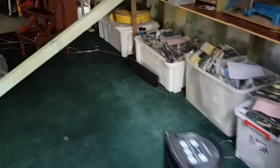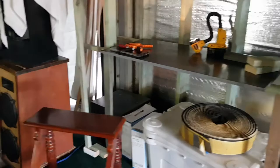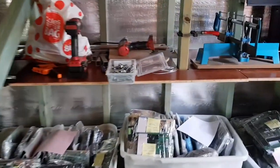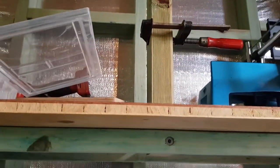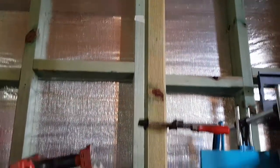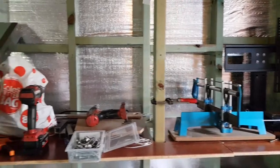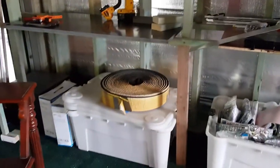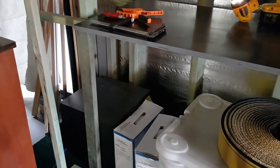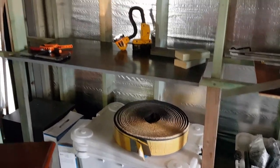All right. I'll just show you something else I did. I got kind of freaked out every time I was standing on this shelf here. I mentioned before, this really lightweight pine is just batten screwed to these pretty heavy duty uprights, but still, taking my weight walking up and down, that's not going to take much of a bump to fall through. So I ended up getting a couple of other pieces of framing pine and just chocking them in there. They're wedged in there really tightly. So I should be able to relax a little bit more while I'm up there now.